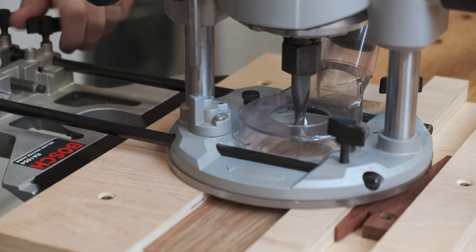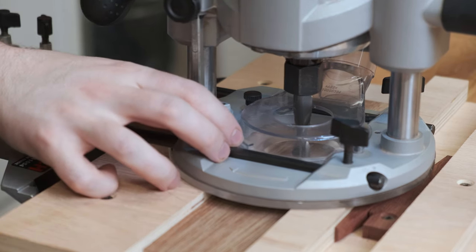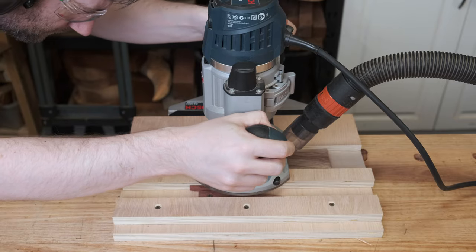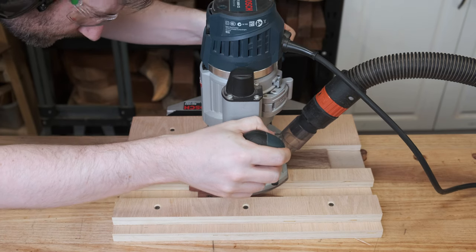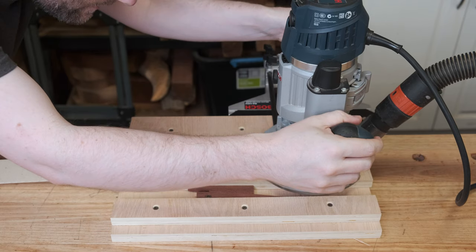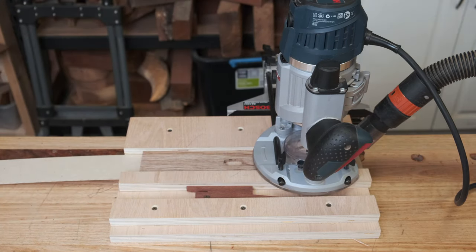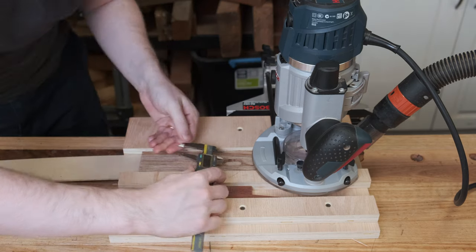The length is a little bit trickier. The standard width for any sized domino is 13mm plus the diameter, so in our case we need a 23mm slot. For the template, that means it's 23mm plus the difference between the diameter of the bit and the diameter of the guide bushing — that's 23 plus 6.5, so we end up with a 29.5mm wide hole in the template.